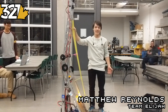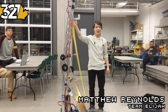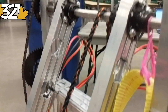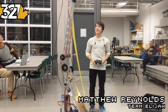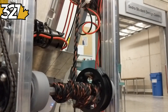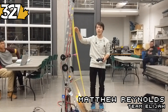For our climber mechanism, this was our least important mechanism so we worked on it last. We wanted to take advantage of mechanisms already built on the robot and designed the hook into our arm. This is our hook — it's a little bit sketch, held together by Velcro, but it actually works quite well. We have a spool at the bottom of the robot with a rope running over the top of the arm to the hook, which is held in place with Velcro. As we run the spool for the winch, it breaks the Velcro and flips the hook over onto the bar. You can see it comes right off the top, pulling off the Velcro, and the hook latches onto the bar. Then we winch the robot up.